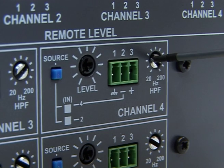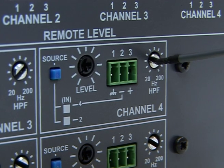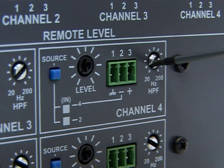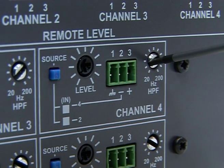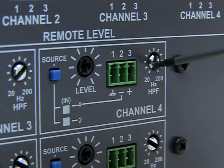For speech, the optimum settings between 100Hz and 200Hz are used. Often this setting will enhance the clarity of speech, reduce microphone handling noise and breath blasts. For music, the optimum setting will depend on the speakers and their transformers, with settings between 70Hz and 200Hz being appropriate.